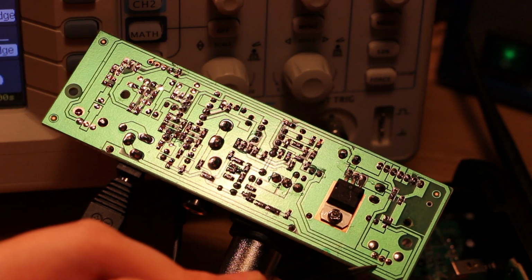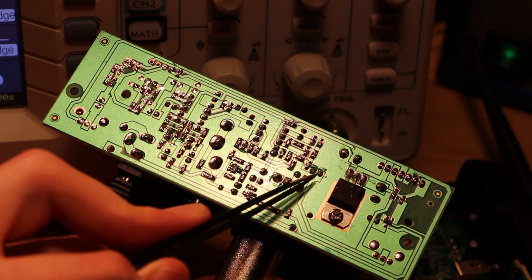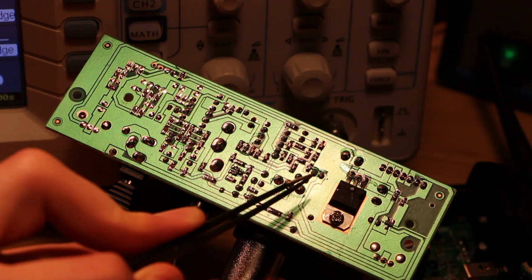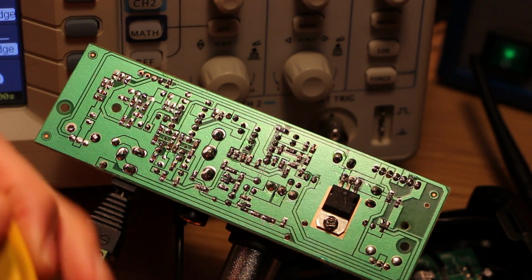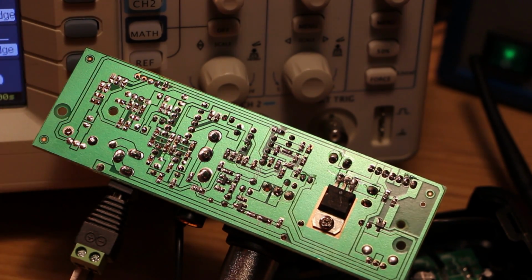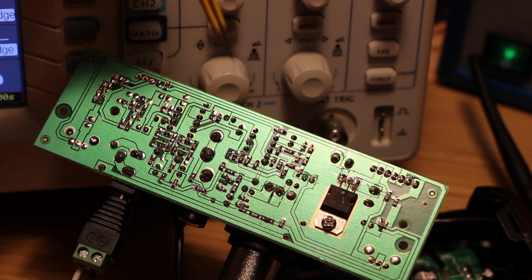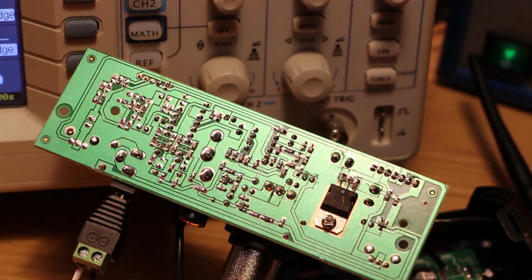All right, so after the audio comes off the wiper of this potentiometer here, it looks like it's AC coupled through another big electrolytic capacitor. Then it jumps over this trace with another 0 ohm resistor. I'm still weighing whether it's worth going deep into reverse engineering this circuit. It looks like really broadly this long unidentified chip is the output amplifier, and this little 8-pin guy is acting as a kind of preamplifier for the signal coming in from here.